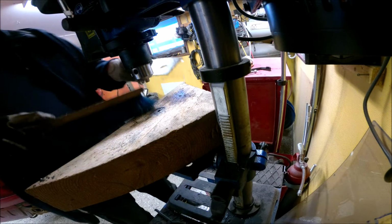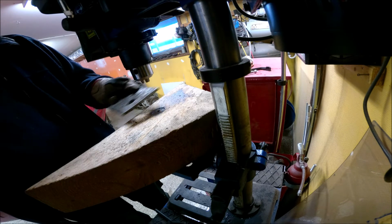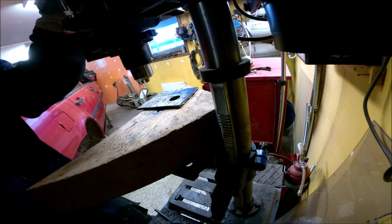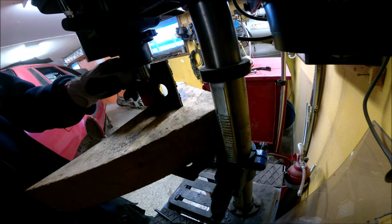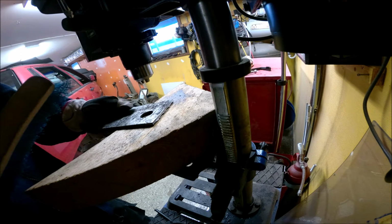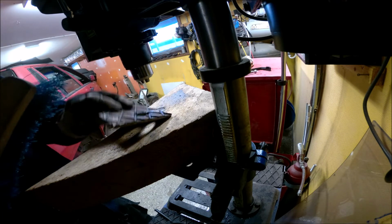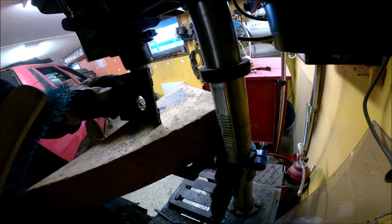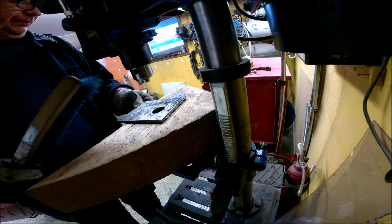So I tried it with a higher RPM. So now I was running on 1300 RPM, but the belt slips even worse then. So I'm not really sure what RPM you should run these cutting bits on, but a cheap belt driven drill press is too weak.